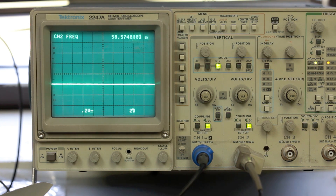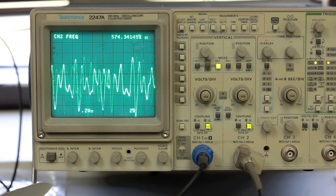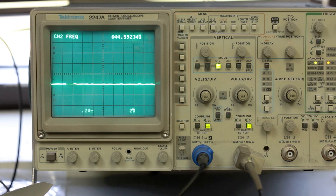My vertical deflection is 0.2 volts per division. When I strike it I'm getting about a volt peak-to-peak, and that's just with the gain set on the differential at about 45-ish. That's pretty good. For all the naysayers saying you're not going to get low enough frequency — there's the E, and I'm buzzing a little when I hit it. The amplitude looks a little lower, but it's still pretty workable. The A is good. The D is good.